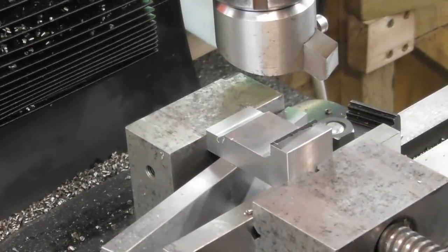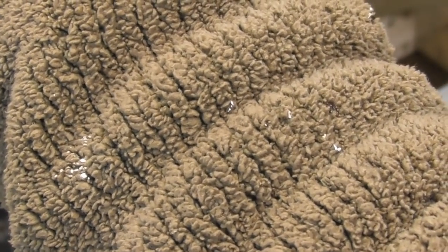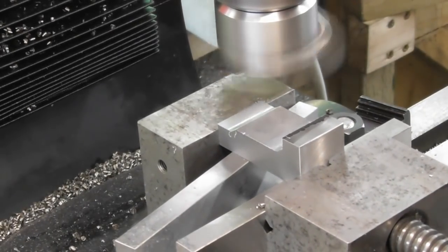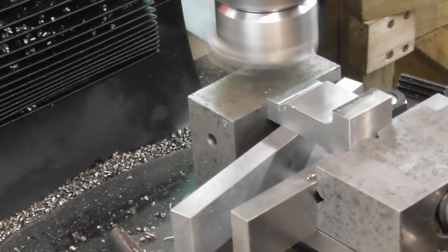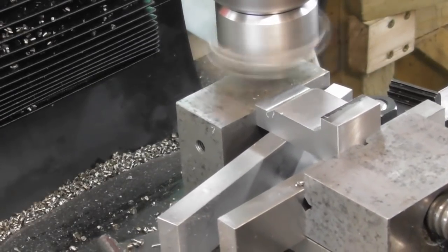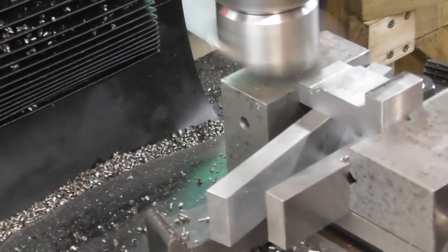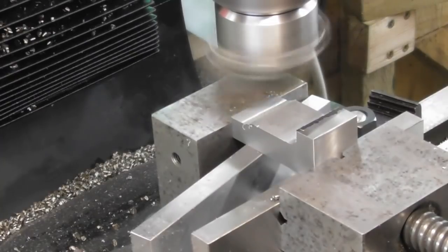A long time since I've had to use dials as opposed to a DRO. Okay, I must get into the habit of slowing the speed right down before I start it up. Okay, so I know I can come into 8mm depth, so that's 0.5mm cut on that very top there probably. There it's touching now. Right, 8.6, so I've got a 9. I'm just bringing the sloping edge further back so that I've got more parallel edge at the bottom. So 9.5.